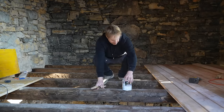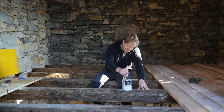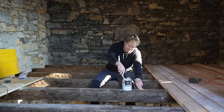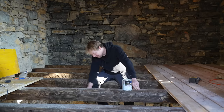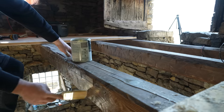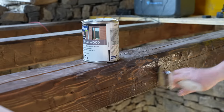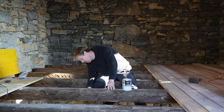Now that the beams are finished in terms of the hand-hewing and staining process, I need to seal coat them. After all that labor-intensive work, if the stain fades I'm not going to be happy. I'm using a colorless sealant - I'd call it a satin finish rather than semi-gloss - which does a nice thing to the color: it enriches and pops the color a little bit more, locks it in, and most importantly protects the wood.